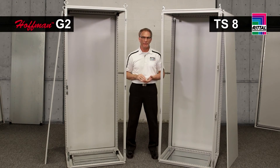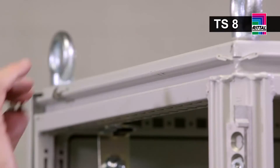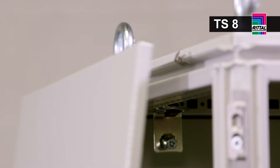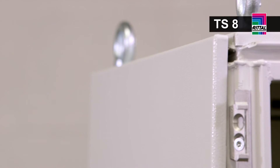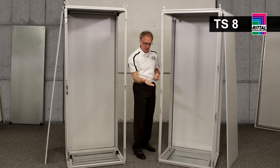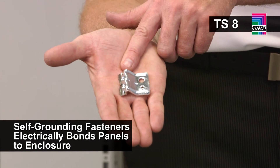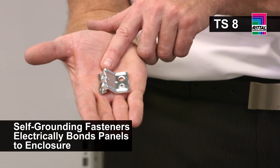One of the biggest design benefits of a modular enclosure system is the ability to create large bays of enclosures, interconnecting enclosures together. To maintain the NEMA rating and complete the construction, you'll need side walls, whether it's a standalone cabinet or a cabinet at the end of a row. The way Rittal handles this is with metal clips that attach to the enclosure frame. We then hang the panel, put six screws into place, and Rittal uses a unique fastener with grounding teeth, which provides electrical bonding of the panel back to the enclosure frame.